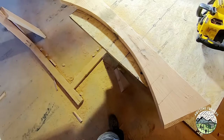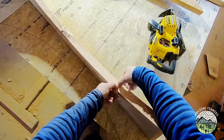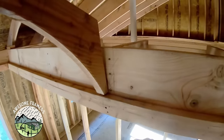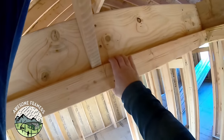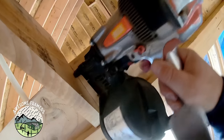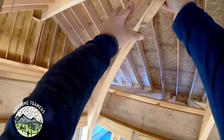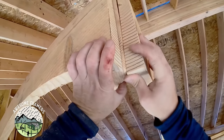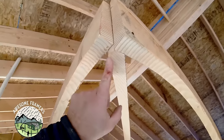When I go to actually finish it and skin it to get it ready for the drywallers, everything's going to plane to the center, so little discrepancies will just float out with the taping mud. After all the layout, all the cutting, the math — now it's time to start framing the ceiling. You can see why I skinned the inside of that tray with a 2x4 — even though those rafters don't plane out perfectly, it's okay, the drywall is going to float that. With all this cutting I never get it exactly on the money, and that's okay — I definitely didn't want it to project into the room, so projecting a little in on that 2x4 is not a big deal. When you go to install these hips, don't panic if at first those cuts don't look perfect — it just takes a little tweaking. Trust the math.